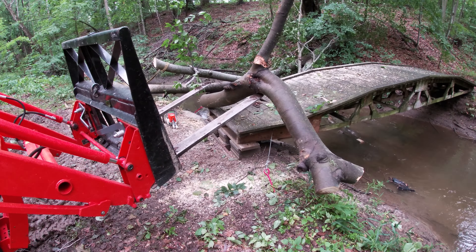Let's take a look at this bridge. I'd put these gussets on here a few years ago because the ends of the truss had started rotting out, and that worked pretty good — it looks like that is still together. But I'm going to have to replace this 2x6 back here, or at least scab another one to the back side of it. The center truss looks okay. The other side looks okay. I think I'll have to replace most of these boards down here and then this ridge board. I had parked the mini truck right there with all my tools, and I was looking at this tree thinking one day that thing's going to come down — and it was literally three days later.